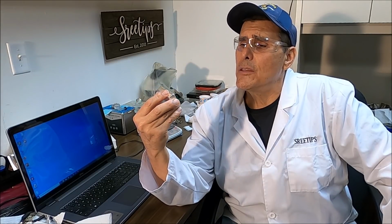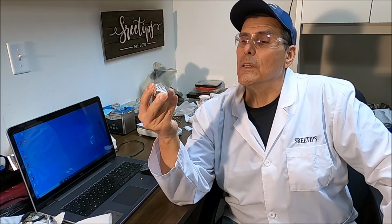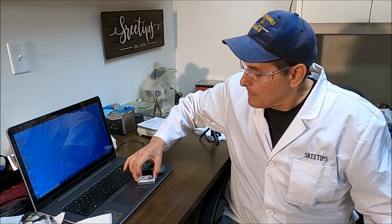The reason I did that is because the other way to be sure that I've got 3 9s here is to run it through my electrolytic silver cell. And I didn't do that. I just melted up the silver, the cement silver that we recovered from the silver chloride conversion process. I lost a few grams. They're out there in the waste buckets, and I'll recover that material later on and get it back.